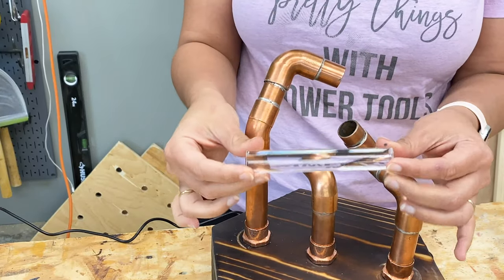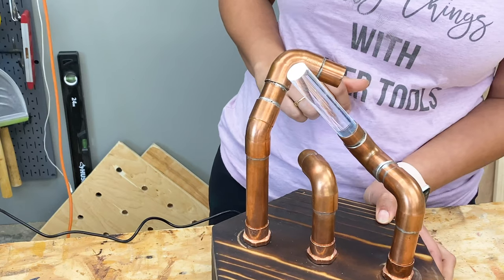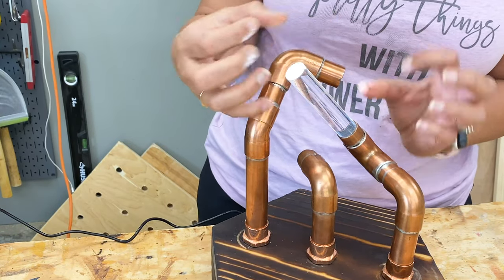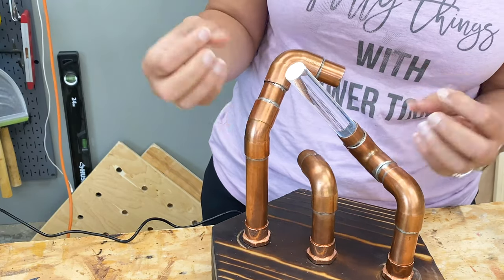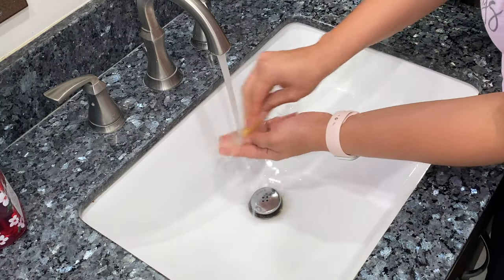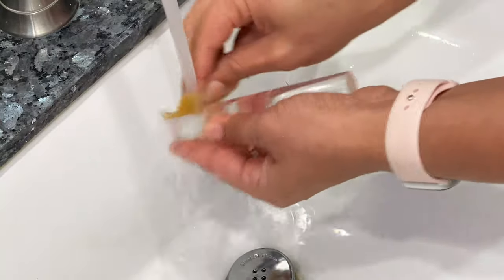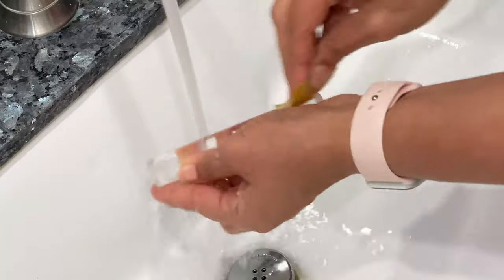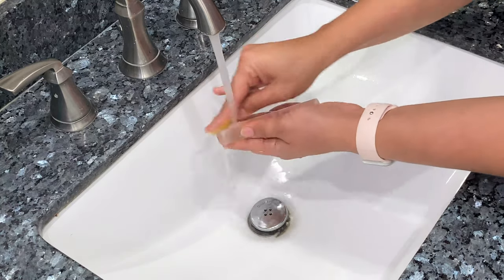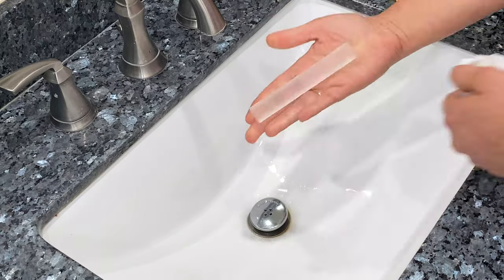Here's the deal — you can only find transparent acrylic rods. But when you put it in and turn on the light, because it is transparent, the light just passes out of the tube. You really want the sides frosted so that the light can bounce around inside and you get a nice glow. So here's an easy technique to frost the acrylic rods: I used 400 grit sandpaper and held the rods under water and started sanding them. It is important to sand in the same direction and around the rod evenly. This is done underwater because the water washes away all the particles from sanding so you don't get any secondary scratches. It took a couple of minutes and you can start to see the rod getting translucent.